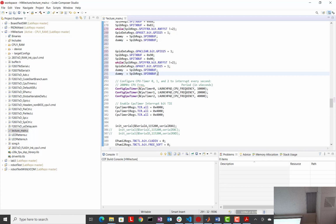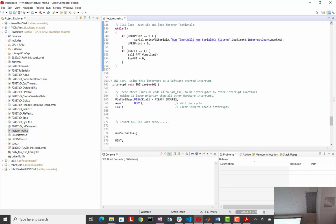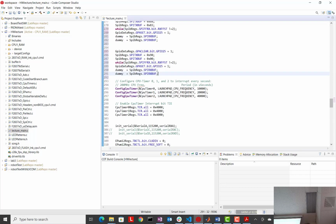Okay? So I actually did forget one thing in this initialization, and because the bits are sent over most significant bit first, where did I lose it? Actually, you need to left shift this 90 by 8. So anyway, that's the appropriate way. Anyway, for that device, let's not worry about that though. The idea is we needed to get that data across to the device.